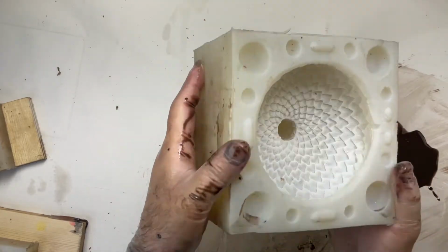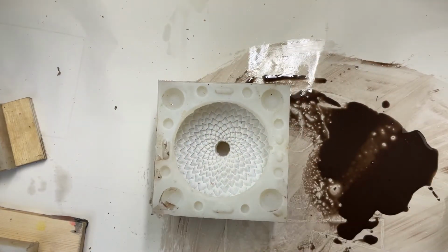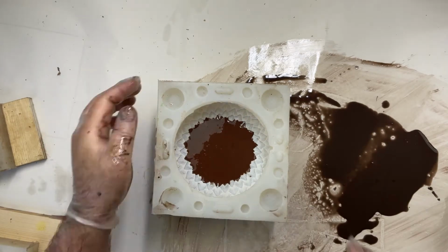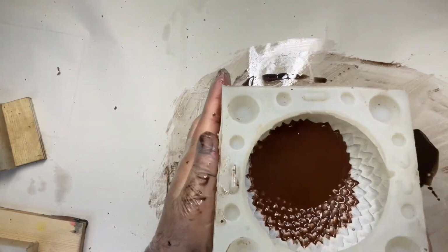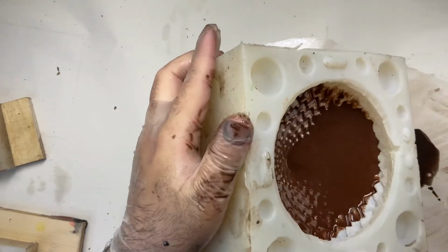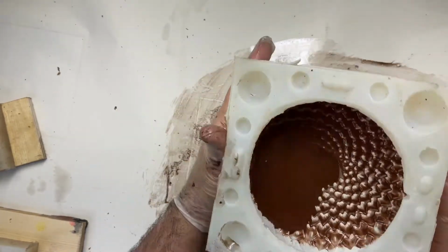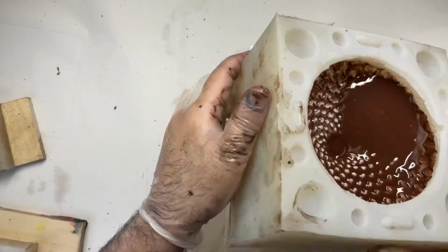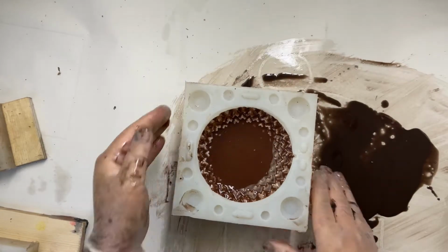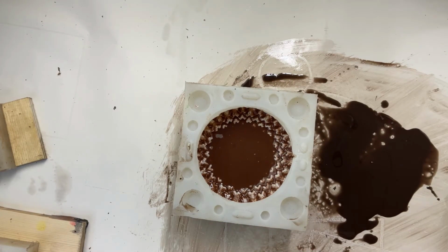For the cap, we pour a little bit in and we need to swirl it around to try to give a light coat of resin over all those little scales in the cap, and this will help reduce the amount of bubbles that might show up in the tip of each of those scales. We're still gonna put it in the pressure pot, but this will just help a little bit more. And if we need further assistance, we can even put some talcum powder in there.